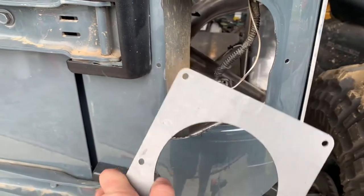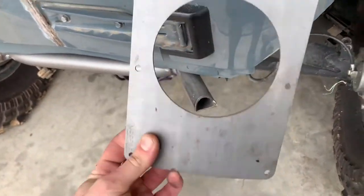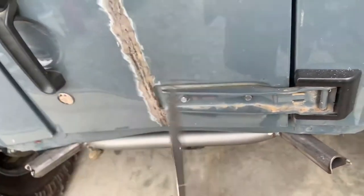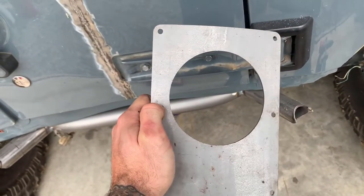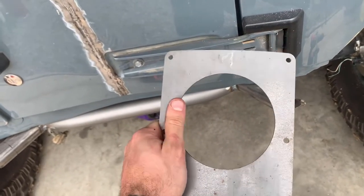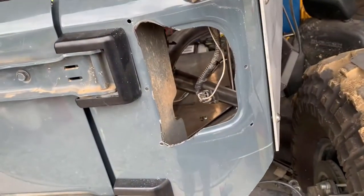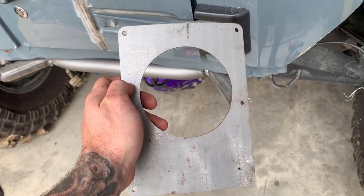But once you do that, paint these suckers up, which I think I'm going to go with steel gray as well. You bolt them up, just a through bolt and a nut on the backside, and then you just get a 4-inch trailer light. Moto-Built sells some on theirs. I don't know if I like theirs, but any 4-inch light with a rubber grommet. The grommet goes in first and the light squeezes into it. And that's it. I think there's some kind of resistor you need to wire in, but yep. So now I'm going to finish up everything else.